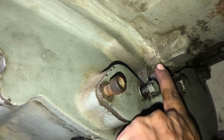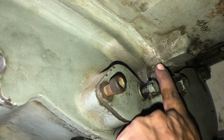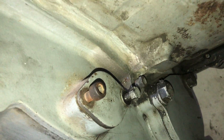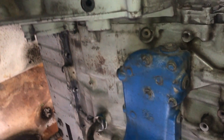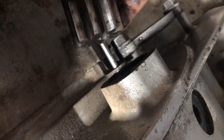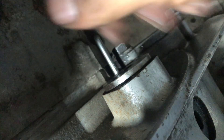This is the timing bolt — the upper one in the manual, but we have lost it. And that is the dead plug we have to remove here. We have to insert the timing bolt, or a screwdriver, or allen key. That is the hole for the turning tool. And that's the mark we have made on the alternator and the fan to make sure that we can rotate it 360 degrees. That is the timing tool from Cat, which can be used on Cat C15 or Perkins 2000 series engine. Insert the bolt here.